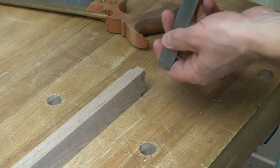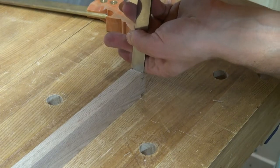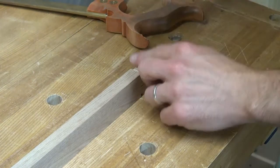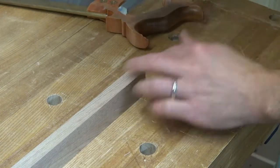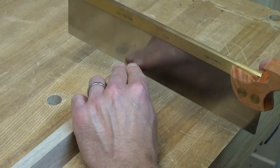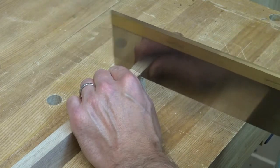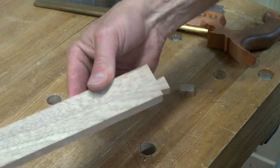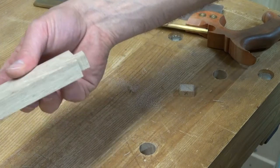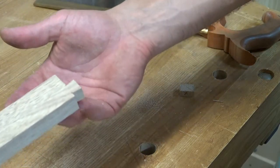For the back shoulder I'm just going to make a little V wide enough to drop my saw kerf in there and then cut it back by hand — you're not going to see it so it doesn't matter if it's a little rough around the edges, though I'm still going to pay attention to my line. Just like that, I've got my nice dovetail with the crisp front shoulder and the rabbet in the bottom so I can reference it against that top surface and mark my socket.